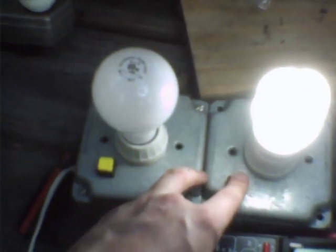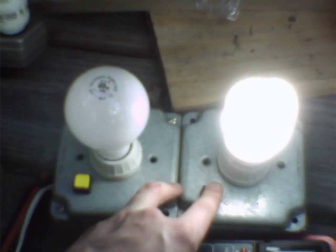That buzzing is the surge current happening 120 times a second. With the incandescent lamp it's just a little ticking noise, whereas with this it's happening 120 times every second. And that's just the lamp as it is — not with any kind of electronic switching.